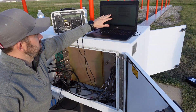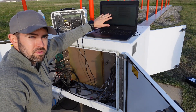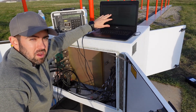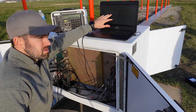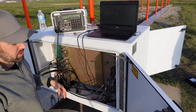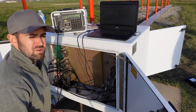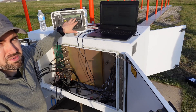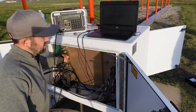I don't always cut the full amount on the first try — I usually cut a little short. Because you can never stretch a cable or make it longer, it's better to cut a couple of times than to cut too much. The calculation doesn't always work out, so I cut short — that's why I ended up with that 3 in the 150. I just made an additional cut of a quarter of an inch, and that gave me a result of 0.000 DDM. That makes it perfect for pair 3. Pair 3 is complete.